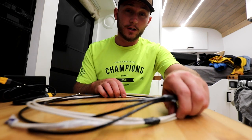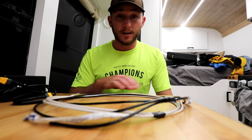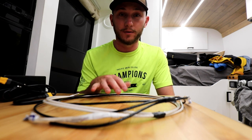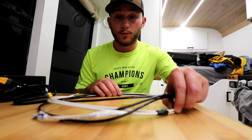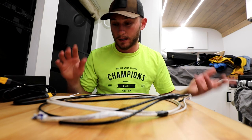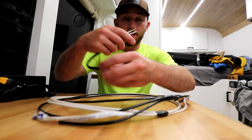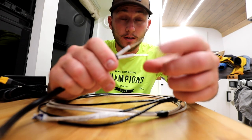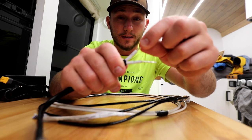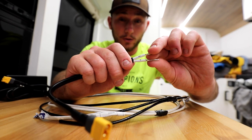I've referenced my wire gauge chart - if you're unsure, please consult an electrician and always consult an electrical wire gauge chart to properly size your wires. I've sized up for extra certainty and gone with 10-gauge stranded wire for the distance I'm running. I'll put in a 25-amp fuse so that at normal draw of 20 amps I won't trip it, but this wire can hold 30 amps, so even if more power is drawn than rated, the fuse will break before the wires. I have two sections of 10-gauge stranded wire to connect to my distribution panel under my bed on its own dedicated fuse line.